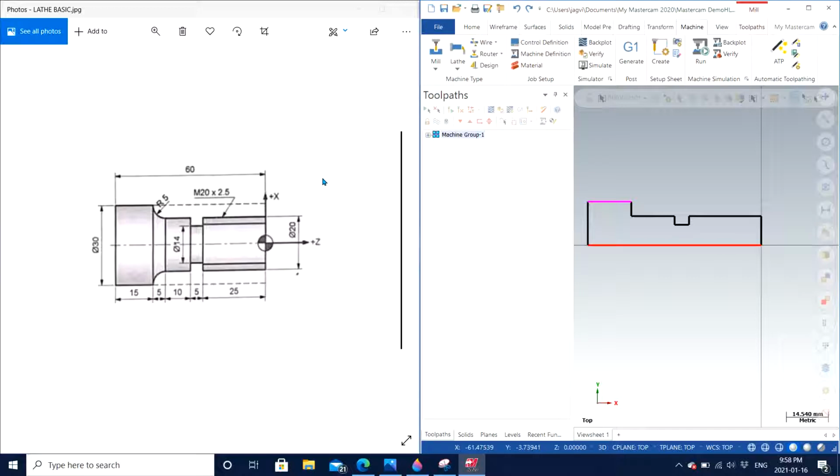if we do have to make any part in any kind of manufacturing, whether it is mechanical, aerospace, or any high precision machining, they always recommend you to have non-sharp edges. The main reason is that sharp edges are the initiation of stress, and wherever there is stress, it becomes easy for any part to break or crack, which we definitely don't want in any kind of industry, whether it is mechanical, aerospace, or whatever kind of infrastructure that we are trying to make or manufacture.